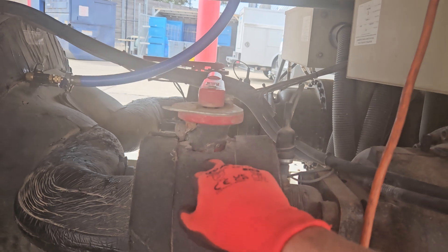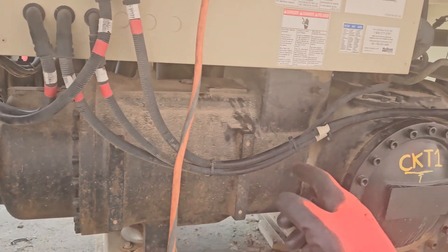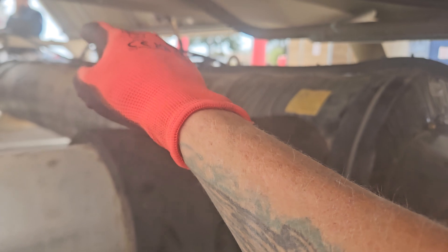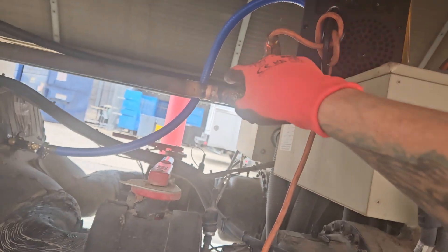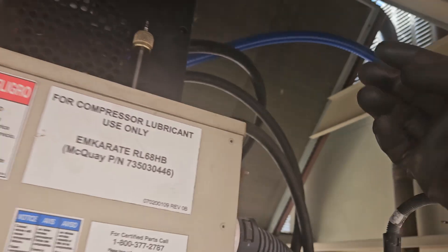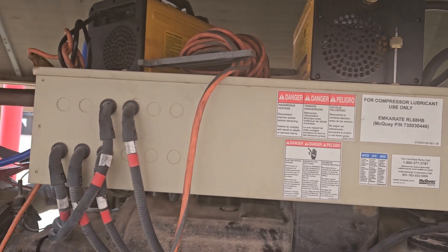The other thing is I isolated the suction line right here at this butterfly valve - that's the shutoff valve for the compressor. So we're blocked here and only have access through the EEV to the liquid line solenoid valve, and that's just one vacuum pump, one hose. Everything else - the compressor, discharge line, the condenser coil, and through the liquid line - is being handled by that pump. And it's working.